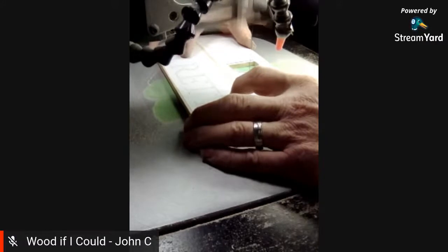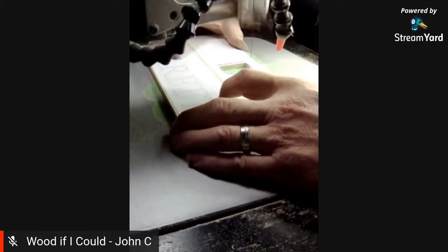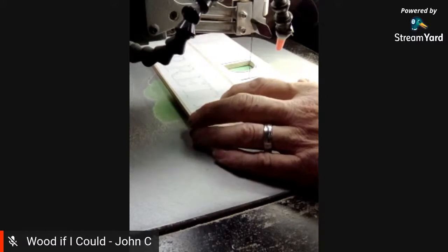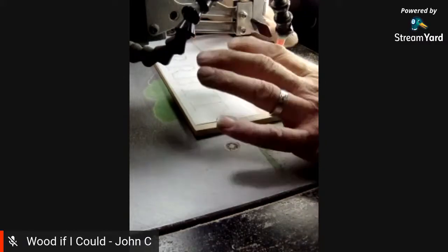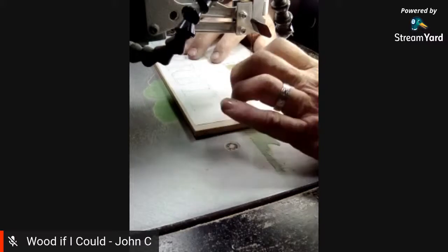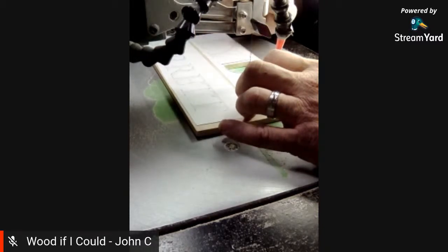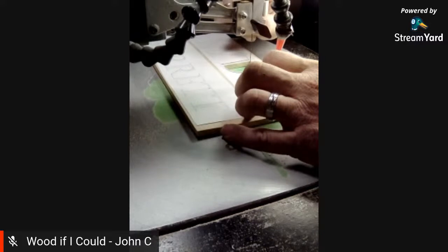Yeah, then he wants to know what saw you're using. I'm going to tell him it's an Excalibur. Lawrence wants a link. Larry. Do you want me to send him the link? Sure, send Larry the link. I'm going to send him the link. Leonard, yeah, I'm using an EX21. I do not have the Pegasus blade attachments on it yet because it's still working for me. I've had it for, I'm going to say, 7 years, and it's still working fine. I've only had one problem with it, well, two problems. One of my blade tighteners stripped out on me, so I basically just retapped it and put a bolt in there with a fancy turn knob on it. And my top tensioning leg is so worn out that I basically just use an emery pad at the bottom of it.